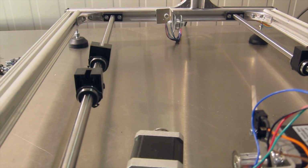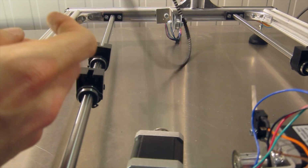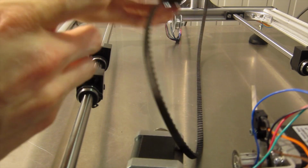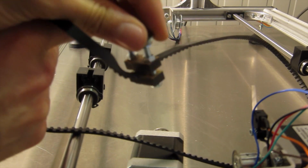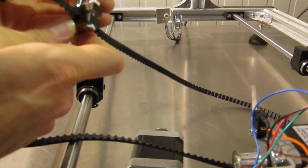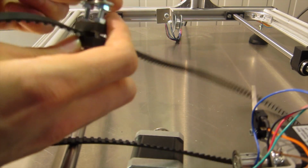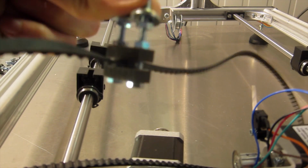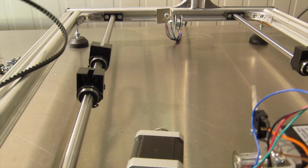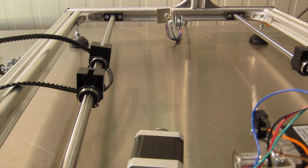Alright, so first take the regular belt that was in here for the X-carriage and close it with 2 of the perforated pieces and some M4 bolts, long ones. I just closed them end to end, but I'm using a larger bearing at the end here, so your length may vary. But you want the same kind of tightness you had on the original X-carriage.